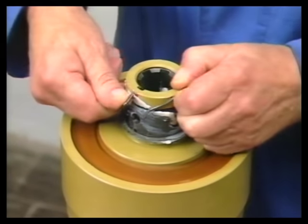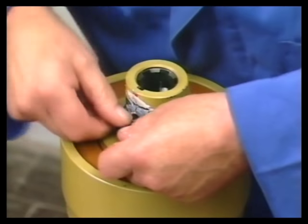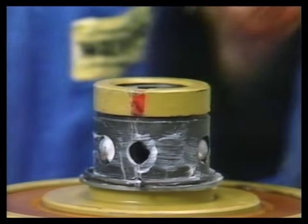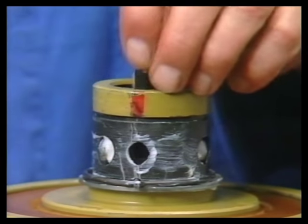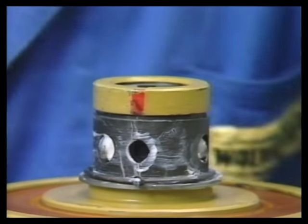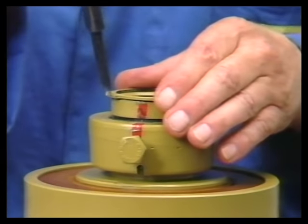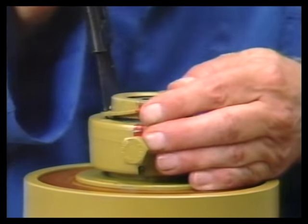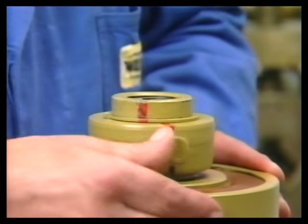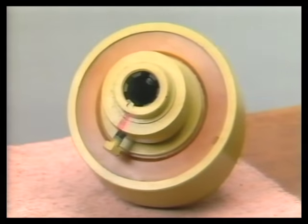Locate torsional spring, secure clamping key with torsional spring in sleeve bore, place retaining ring into position, note direction of rotation. Secure by circlip and check functioning of QC lock. The cam switch coupling K64 is now ready for use.